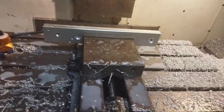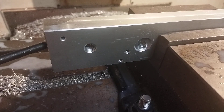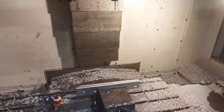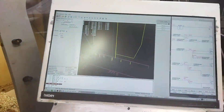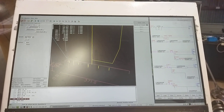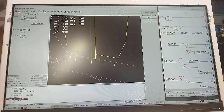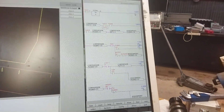I'm just making some parts here. The holes are all rigid tapped, everything's machined, deburred, and everything done off the machine. I just wanted to show you guys what LinuxCNC is actually like and what you can do on a big machine, because I don't think there are enough big machines done with LinuxCNC and people don't trust it. So this is what you can do.